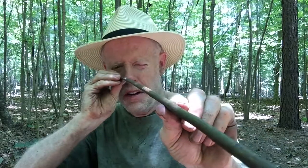What you're going to find is as your wood heats up, you've got heat in it — it's really flexible, and that's okay. If it's making it plastic, that's what you want it to be so you can straighten it out. You're going to look down it, decide where there's a crook in it, and bend that. You're training it right now. Once you take the bark off you'll do your final. The heat is going to allow this wood to become plastic so you can straighten it out, and that's what you want.